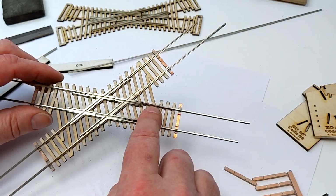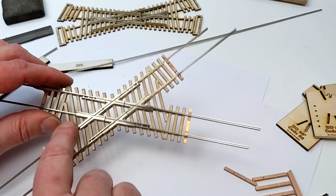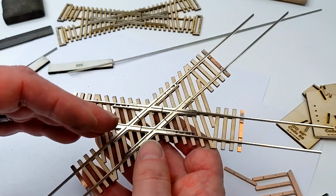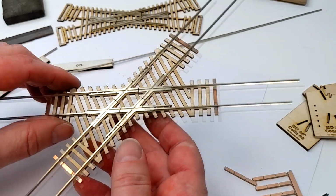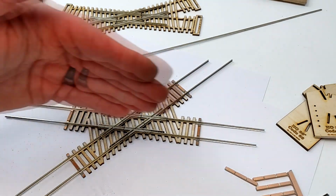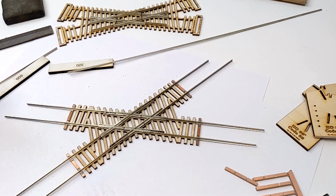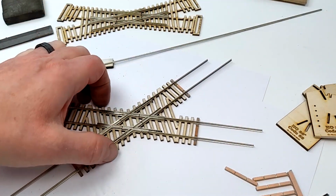You just set a feeder wire onto the side of the rail or even onto the tie. One there goes down to the frog juicer. If you're using DCC, when the train approaches the crossing, if this is the wrong polarity, it switches it for you. Otherwise, you have to do it the traditional way from a switch machine using a relay, and it would switch this frog relative to the route of the turnout that's feeding in it. So if you had a turnout switch that's going to cause a train to go this way, it'll flip it one way or the other way.